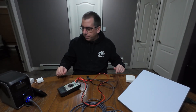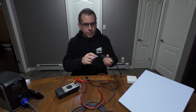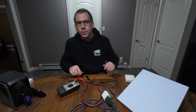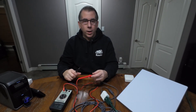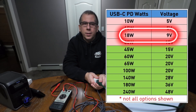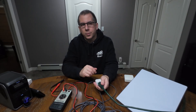Now we're going to change this up one more time. We're going to use the USB-C wall adapter that you might be using to charge your cell phone. I'm going to plug that in and plug in the USB-C to it. Let's see what the voltage is off of this — 8.9 volts. Why is it 8.9 volts? Because again, even though it's USB-C, this adapter is rated at an even lower rating than what the cigarette lighter adapter was.